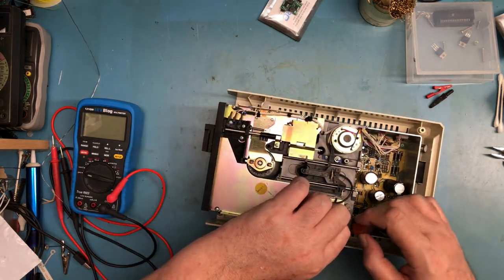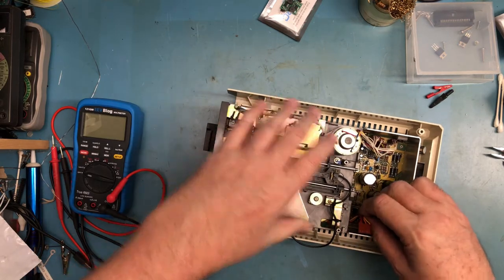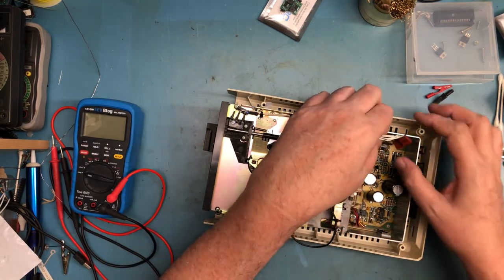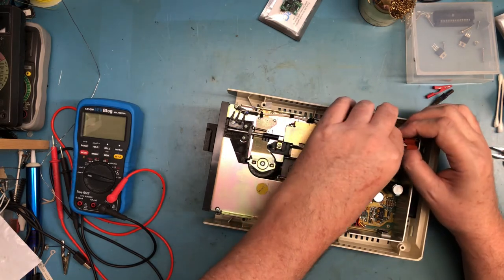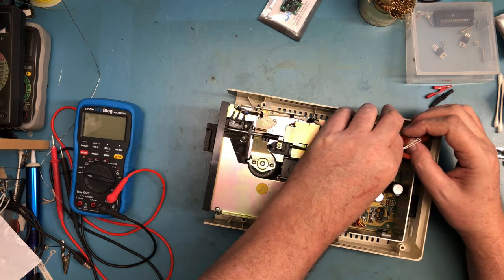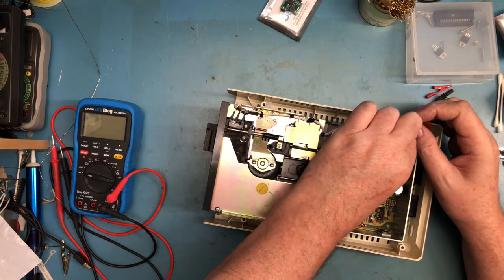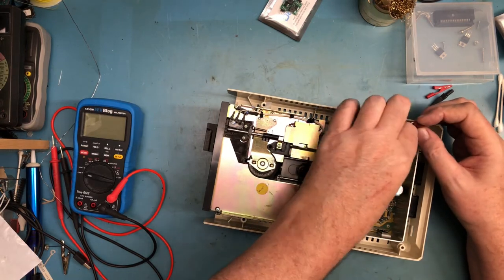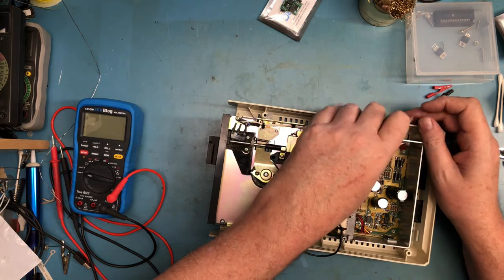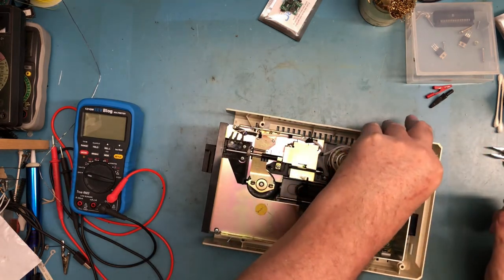That cable, however, doesn't go like that. It needs to come. Oh, come on. Goes on there. This has got J11. Goes there, and then J12 next to it. And then this guy, which is 180 degrees spun around in the middle, and then 10. Why does that seem wrong? J14, J10. It's actually marked on my silk screen.